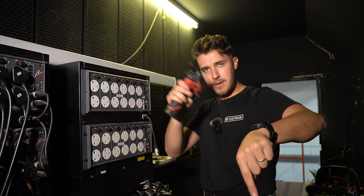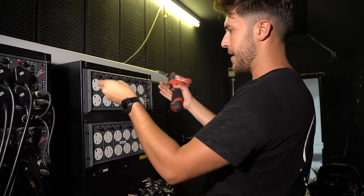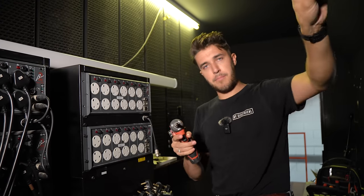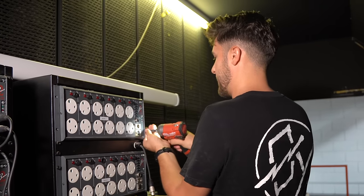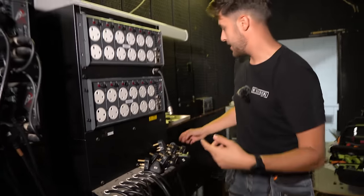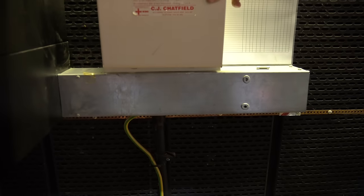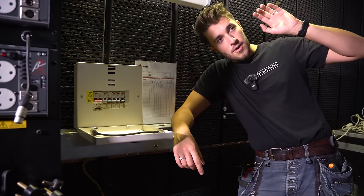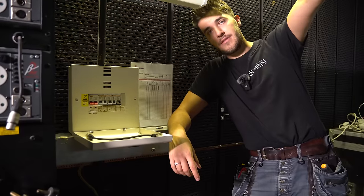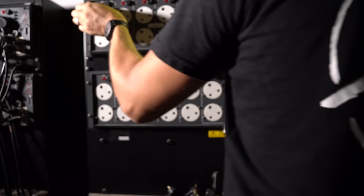Let's get this whipped off. I just want to have a look behind, because we need to figure out a way of making it all look nice as well. Instead of controlling each individual rack, we're going to have the DMX line come straight out of the multiplexer — the thing that controls it — out to the actual light fitting itself on a separate DMX cable. That means these can basically just be replaced with a little consumer unit, so maybe a circuit per metal row. I'm not sure how we're going to make the trunking look nice. Also we've got only one earth wire doing the whole lot, and ideally if you've got separate circuits it'd be nice for them to be on separate CPCs.